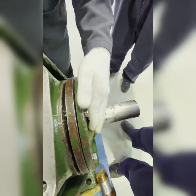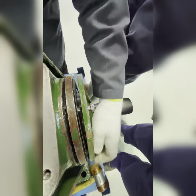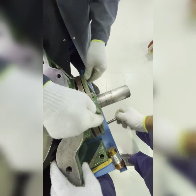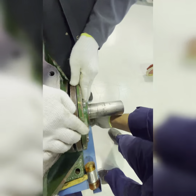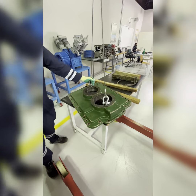Before bringing the cover, the grease nipple should come up — remove this. Insert the shims, whatever shims you have. The grease nipple should be up. This gearbox is designed with the grease nipple slightly slanted at an angle — not exactly vertical, but not down either.